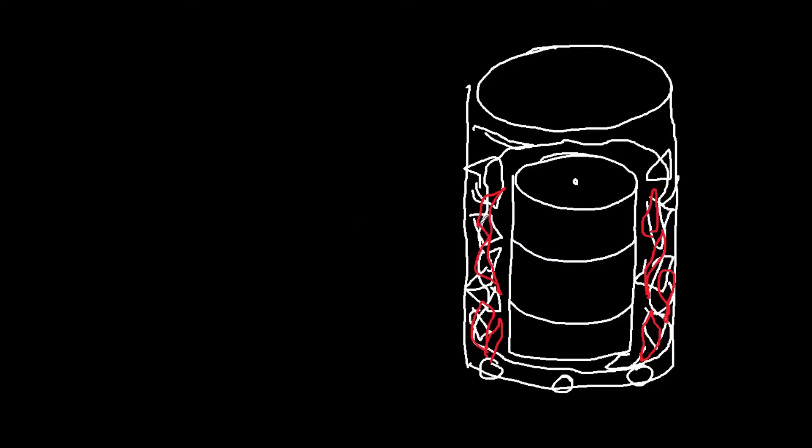One thing I forgot to mention: there's a little quarter-inch hole — you can see the little white dot — that I've drilled in the bottom of the smaller barrel, and that will act as a vent for wood gas to escape from. Now the first thing you notice when you start to burn is smoke will start to come out, and that's actually more like steam — it's just driving off the water from the wood inside the char barrel.